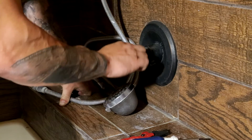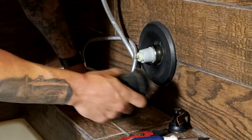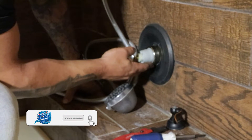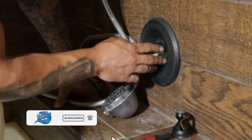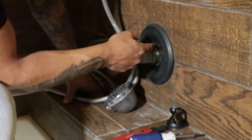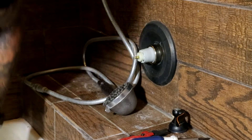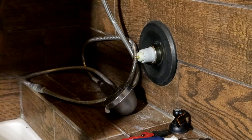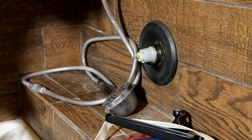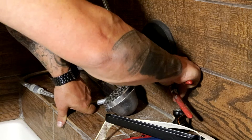Make sure all the water and pressure drains off, then remove the trim ring. This ring sometimes doesn't come off — it can be seized on there. You can take the trim plate off and cut it as a worst case, but you'll need a new ring. The best thing to do: don't use channel locks, because when you grip this ring, if the installer didn't grease the threads, you'll actually squeeze it tighter to the threads.